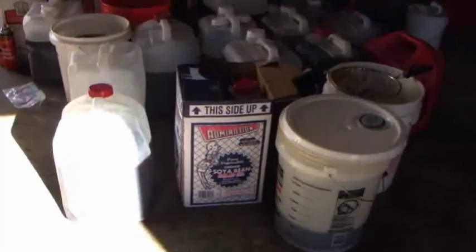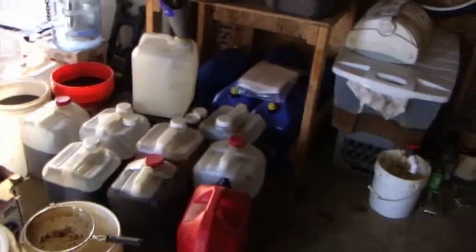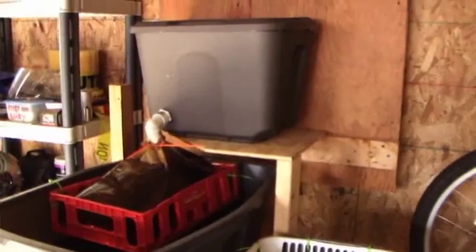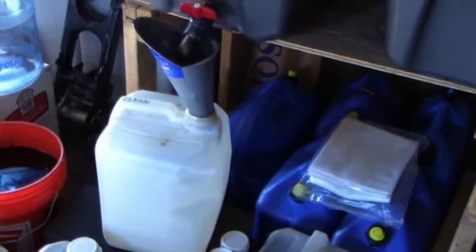This is how I filter the oil. This is all used vegetable oil from restaurants — restaurants call me, I go pick it up, bring it to my garage and filter it. I use a filtration system that I built, so there was some cost involved. It goes through a 10-micron cloth bag and filters down kind of like an automatic drip coffee pot. Pour it in this top tub, it goes through here into the filter, and then right into this big tub. I drain the final product out into a 5-gallon container, which I charge $7 for.